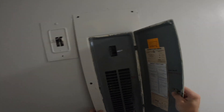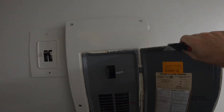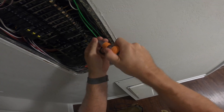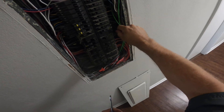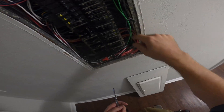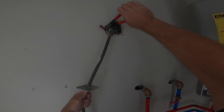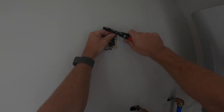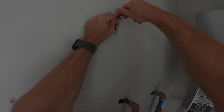I went to take the cover off but it's still hung at the top, so I'm going to take my knife and get it loose instead of pulling it and ripping drywall. You're going to see a big gob of mess in this panel — it's one of the messier panels I've seen in a while. Now I'm just disconnecting the wire from the double 30 amp breaker. It's a two-pole 30, so I'm going to get both wires out. Then I'm going to cut those wires — there's plenty of wire in there — and strip the neutral and one of the blacks.